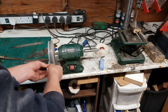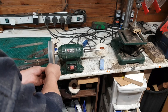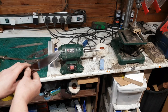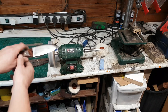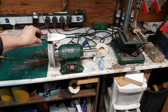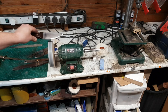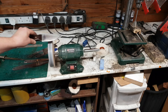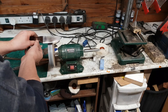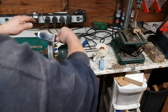These are wax bars which have got very fine compounds in them. Now you have to be careful — the wheel is spinning this way, so the last thing you want is to put your knife going the wrong direction, because if it catches, it's not nice. You want to get your angle so that when you come across with the blade, you're always at the same angle. Some guys will mark up on the side of the wheel to give a rough idea, but you'll get a feel for it. Then naturally you're just dragging it across — it doesn't sound very good but trust me, it works.